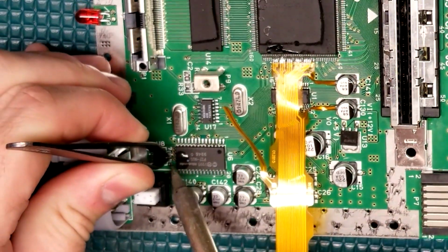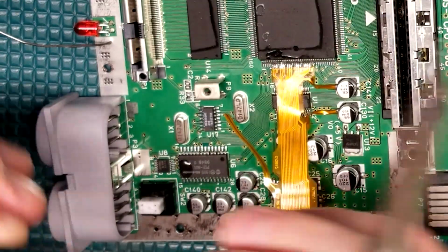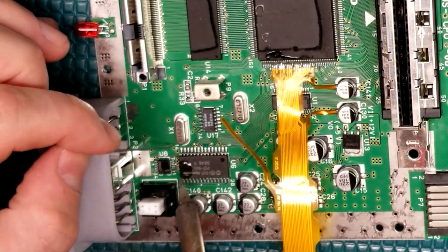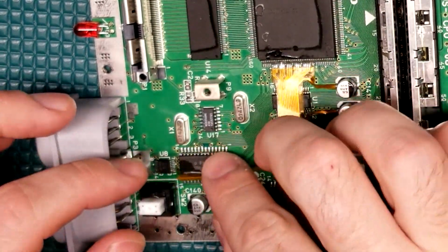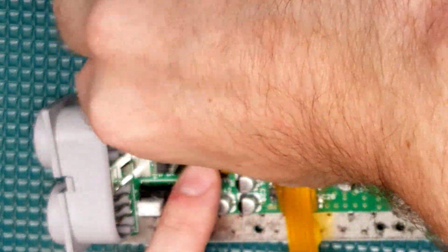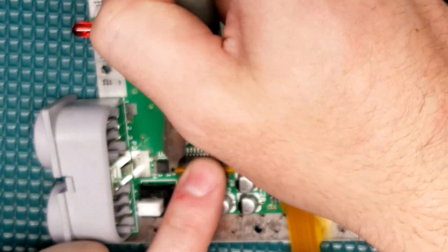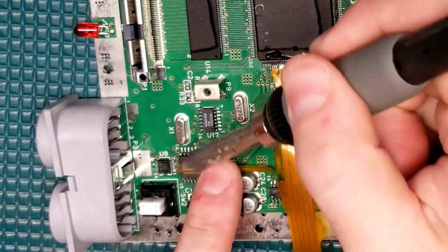So the last step is to solder this last lead of the FFC cable to the PIF connector. And it's a really small via, so I'm making my life a little bit easier by actually soldering a component leg to the PIF connector and then soldering the FFC cable to that. It's an extra step, but it honestly makes things significantly easier, and I just wanted to point out exactly what I'm doing here, as it might not be completely obvious. Also, I'm going to link the installation guide in the description below.